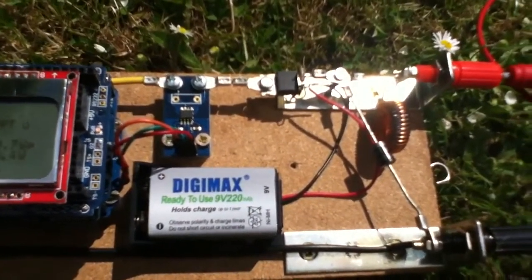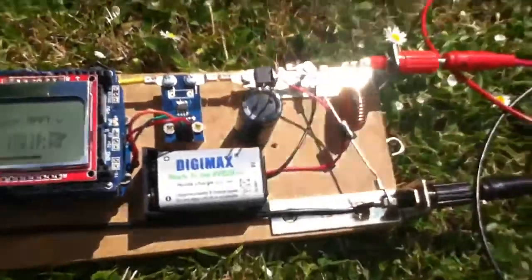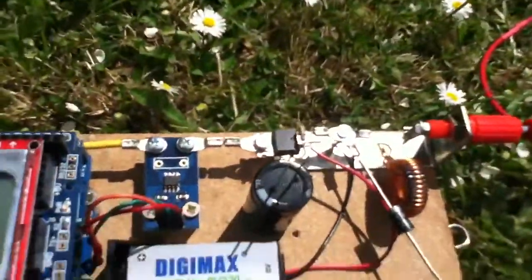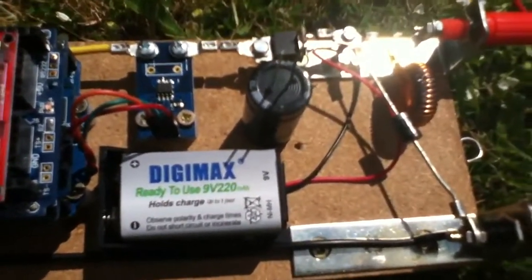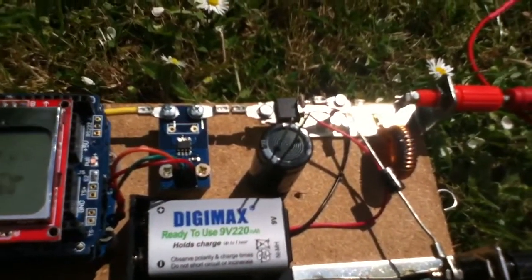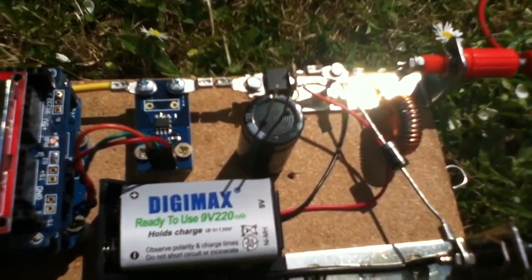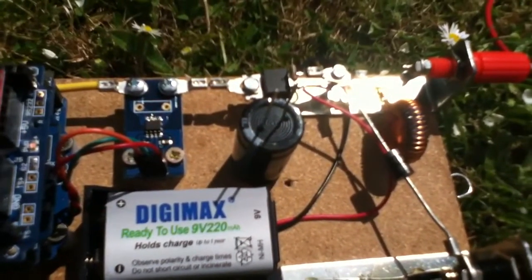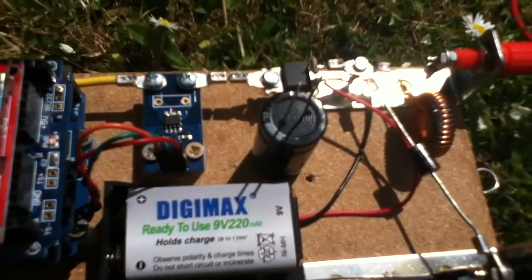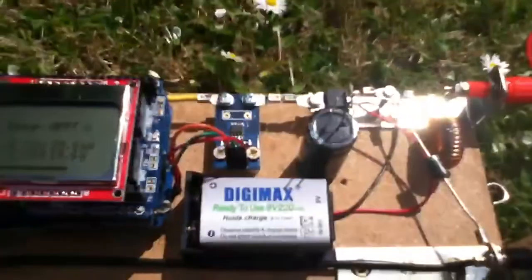The next step for this circuit is to put in an oscillator — preferably with variable frequency and variable mark-space ratio. I also think we're going to need a capacitor. I've got one here: it's a 47 microfarad, 35 volt. I've no idea whether it's low ESR, and this circuit most certainly will need a low ESR — equivalent series resistance — capacitor. Then get it all going, get it oscillating, see what frequency is necessary. This inductor I'm almost certain is going to be too small, both from a DC current point of view and from a magnetic storage point of view, but let's just see what the circuit does and whether we get any DC shift.